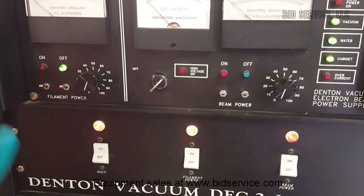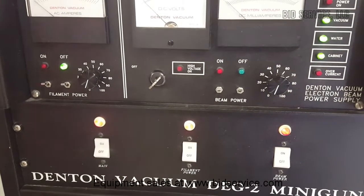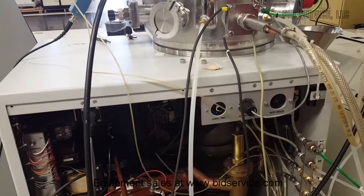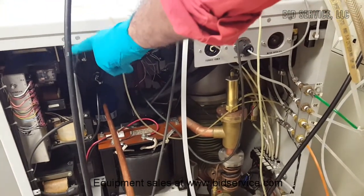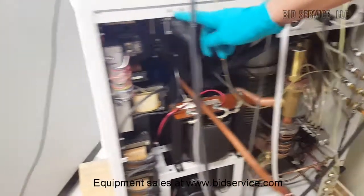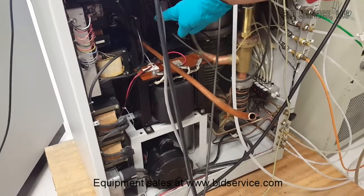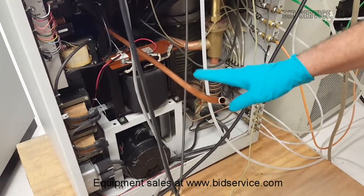Once the system is turned off and in order to vent the chamber, it should give sufficient time for the e-gun to cool down. These are the electron gun water lines, and we have to make sure that the water lines are always connected and there are no leaks. This is the water flow switch — the interlock signal is interfaced through this connector to the power supply. The shutter signal is also through this connector, so you should make sure this connector is properly connected whenever the electron beam gun is being used. There is a mechanical component to avoid oil vapors condensing inside the electronics and transformers area — an exhaust can be connected to this.